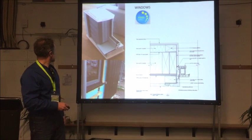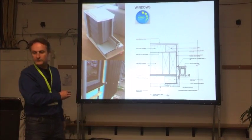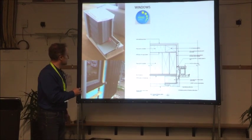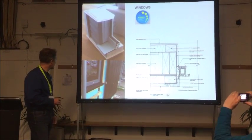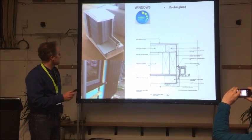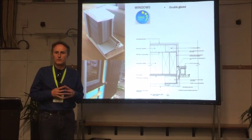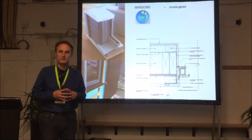You could do a nice warm energy efficient house and still have holes drilled through your aluminium window frames to the cold air outside — that is standard practice in New Zealand. There's also a heavily recessed window, European style, with a purpose-made flashing. This is what we did in the 10-star home — we recessed the window. I see windows as a hole in the wall; they're a tenth of the thermal value of the wall, so that's how you need to think about it.